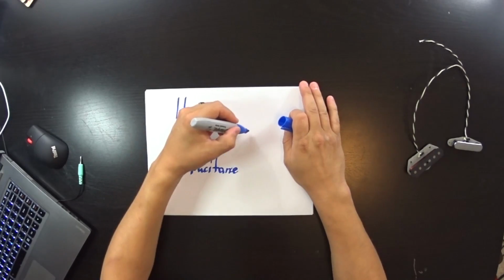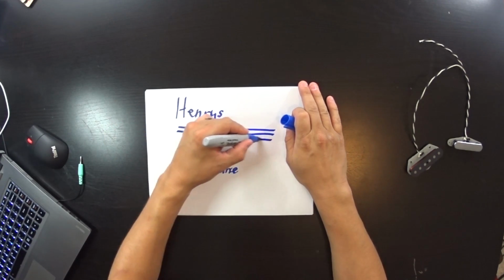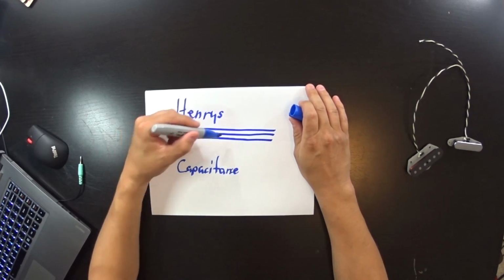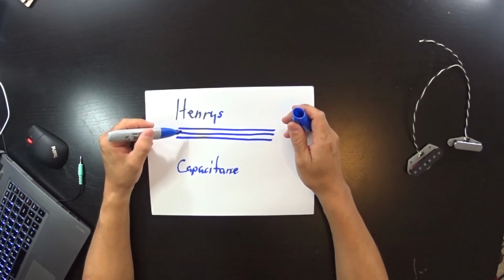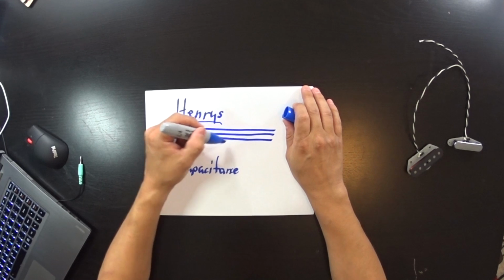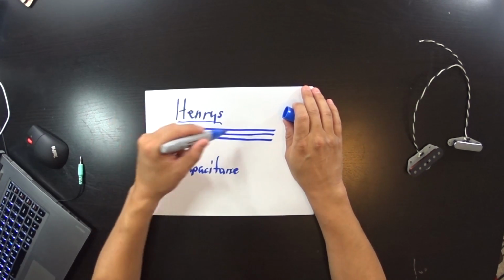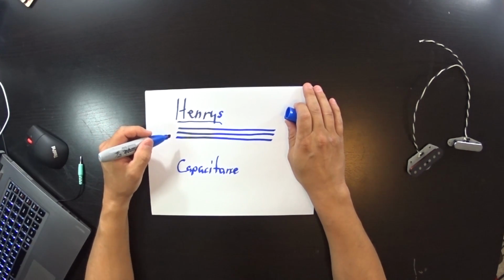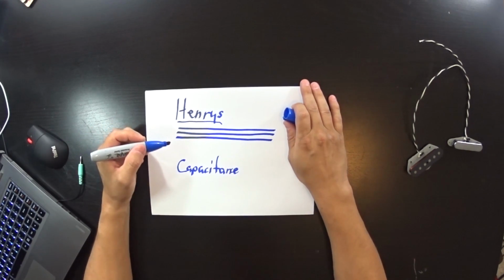So if we look at our pickup, and we're going to express our pickup as 3 wires because we don't want to make 10,000 on this piece of paper. When they are laying next to each other in that coil, that's pretty efficient as far as the henries are concerned. Now the interesting thing is, the neater they are in there, the more efficient that pickup is going to be, and the higher number of henries, the higher the inductance of the pickup is going to be. Not as a rule, but pretty much. We'll just say it for our purpose of our conversation.